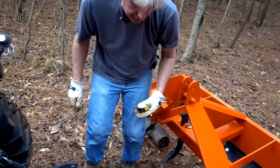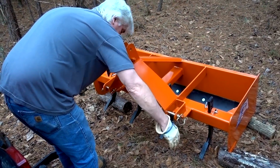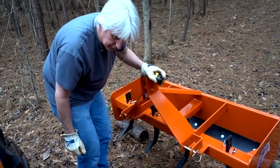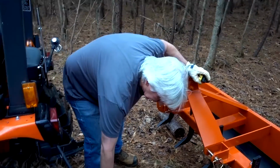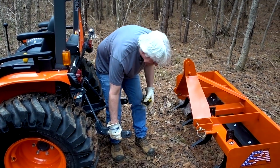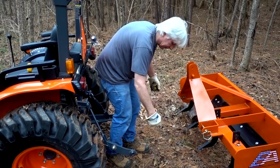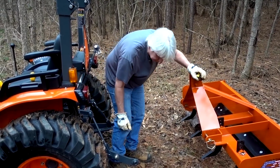So now, when we back this tractor up, we want to try and center it. Obviously, it's not going to be here because it's squeezed in right now. We'll have to move them out. But we want to center it between these so that we can easily pull them out and hook them up. When we first started out, we were backing it up, and we had the thing raised up. Brian was driving, and he raised it up till it was right in line with this. Start backing up, it's going to hit. So now, do I get between this tractor and this box blade and try and line these things up so that he can back into it? And I try to keep them both lined up, not getting my fingers pinched between there, not getting run over by that tire or have that box blade get pushed over on me or something.